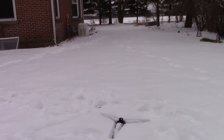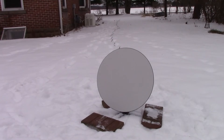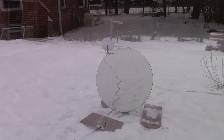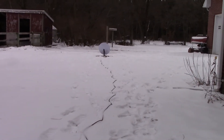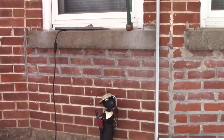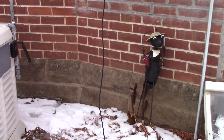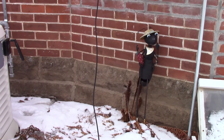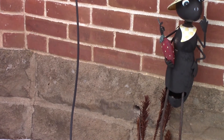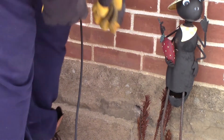The next step was to place the base where we scouted a clear view of the sky using the app, install the dish into the tripod, then run the cable toward the house where you'll bring it in through the wall. As luck would have it, I used to have a 10-foot C-band satellite dish back in the day and still had the hole through the wall into the basement where the cables were run for that. So I decided to pull out what was left of that cable and reuse the existing hole so I wouldn't have to drill a new one — we have a brick house, so going through the wall is kind of a pain.